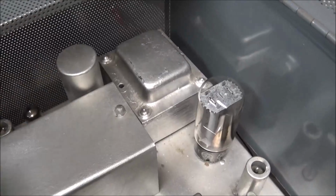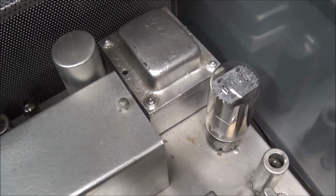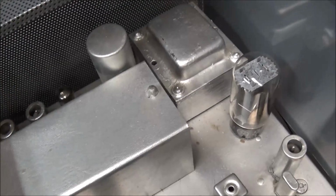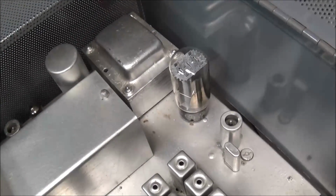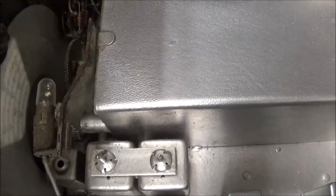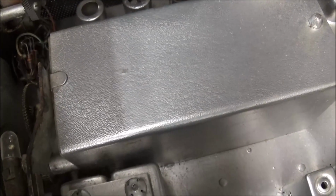It's an old can style. That old thing's got to be pulled out, and we're gonna go back with a Hayseed Hamfest style capacitor in there. In fact, I'll probably go ahead and order the whole kit from them. I think it's around 40 bucks for the capacitor kit. Not a lot of electrolytics in here to worry about under the bottom. We do have some molded paper caps that'll have to go, but yeah, she's intact. And you see that stuck VFO or main tuning knob. Knob works, but none of the mechanism is turning, so we'll have to get that checked out.